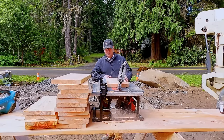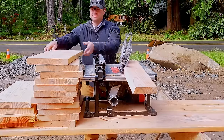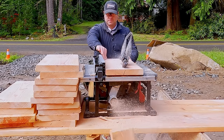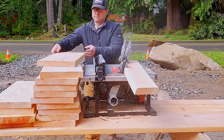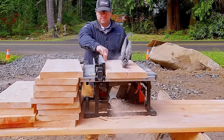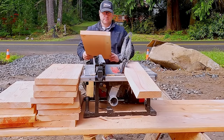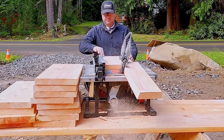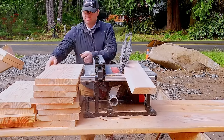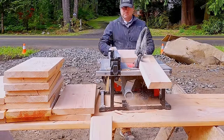This is the little, I believe it's an 8 1/4 inch cordless Milwaukee table saw. Since then I've put in a Diablo blade and it does rip a whole lot better. I should have done that to begin with, but it did okay. Just overheated the battery, right? I think that this thing works really well, even on a 22.5 degree bevel, because it's a 5/12. The riving knife keeps it from binding, and the little anti-kickback just does such a great job. And even the guard popped up like that does a good job. So yeah, guards can be a hassle, but I've just been like 99% really impressed with the guard. That 1% irritation is just the price of safety.